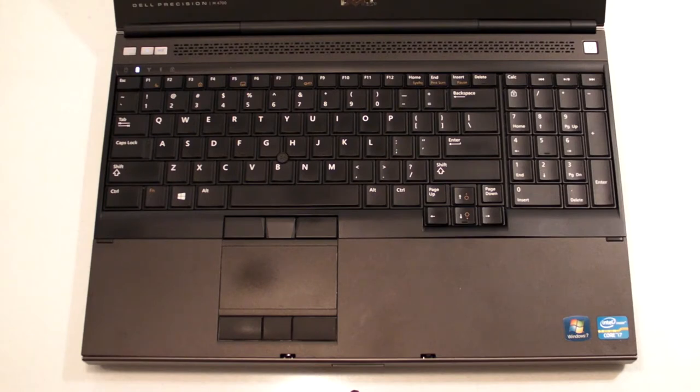Now, the second reason why I think that the problem is a graphics card is this machine has always had graphics card issues. It's always had strange graphic behavior, where the screen flickers or even goes out for a few minutes and then comes back. And the person who's using this computer has reported that's been a behavior that's happened for a long time, but very randomly. So it's hard to figure out the cause or the source of a problem when it happens intermittently.